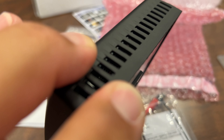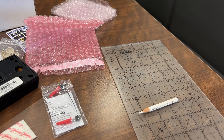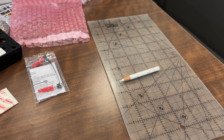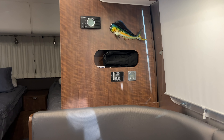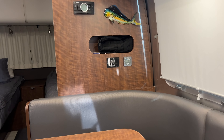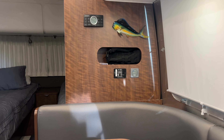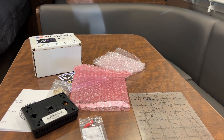Look at the vents here — top and bottom. So if anybody's worried about covering up these holes in the back, that's not a concern at all. I'm going to utilize a measuring device. Don't use a level — it's just not going to be accurate enough because you may not have your unit level. You're going to want to measure from a reference point, which I'm going to use that opening where all the chargers go. That way, even if it's not perfectly level or wasn't cut correctly at the factory, it's going to look as close as possible.